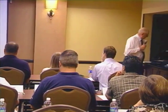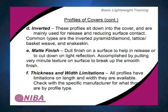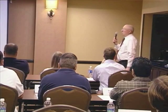We talked a bit about thickness and width limitations. All profiles have some type of width limitation. In rubber, generally it's at 72 inches — if you want anything wider you're going to need a longitudinal splice. Some profiles are made up to three meters wide, others only two meters, and some only 1,500 millimeters (59 inches), depending on the manufacturer and what kind of drum they have. A good stainless steel two-meter-wide profile drum today will cost a manufacturer around $125,000, so check with specific manufacturers to see what is available.